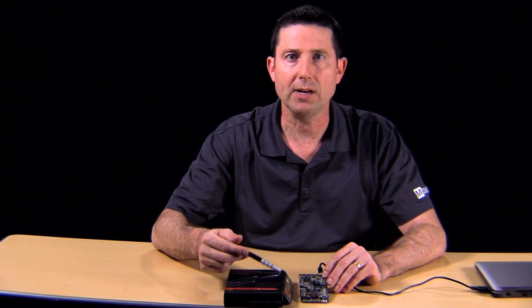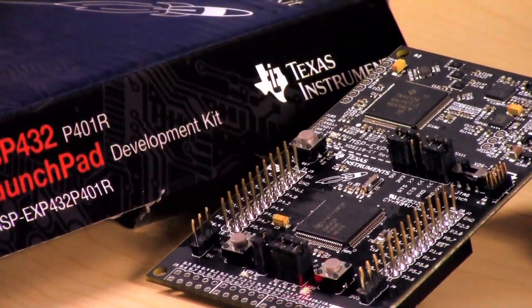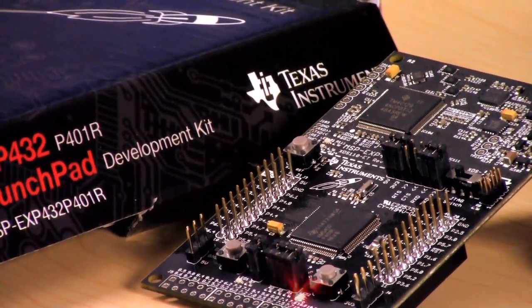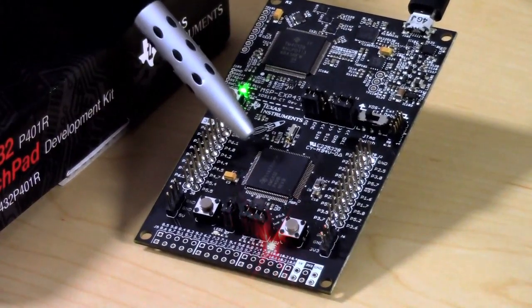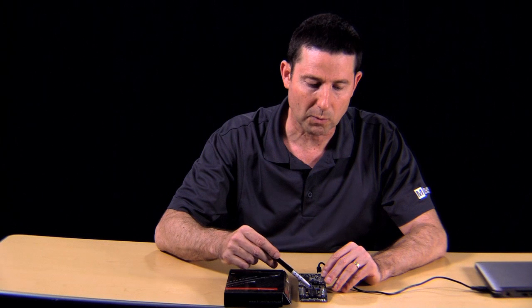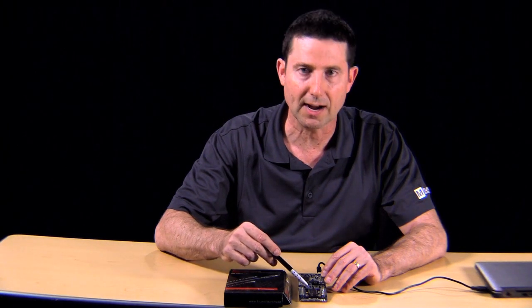It's a 48 megahertz MCU with the industry's lowest power Cortex M4F. It operates at under 100 microamps per megahertz when active, and in standby mode operates around 850 nanoamps. It can take a wide supply voltage range of about 1.6 to 3.7 volts. Inside it has a high-performance A-to-D converter that operates at about 1 mega samples per second and is 14 bits. It also has a secure MCU environment and is easily portable from MSP430 designs familiar to engineers doing low power designs in a TI environment.